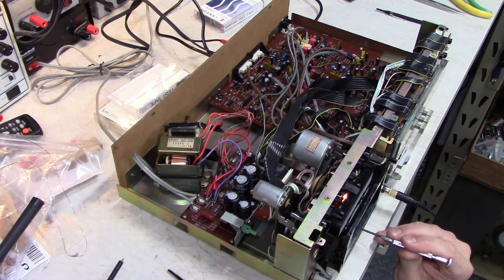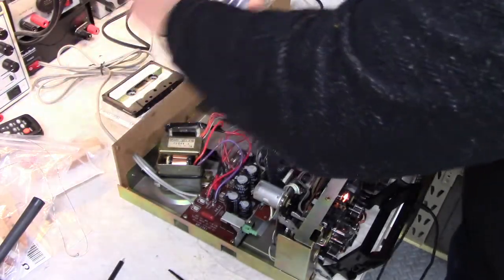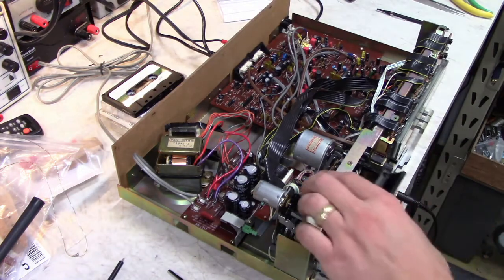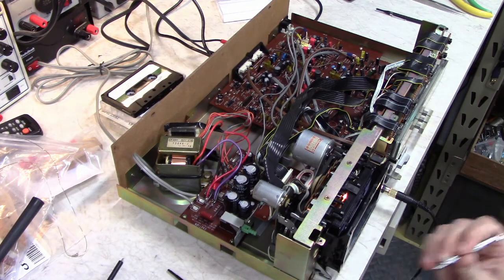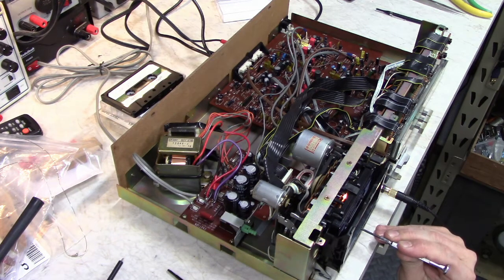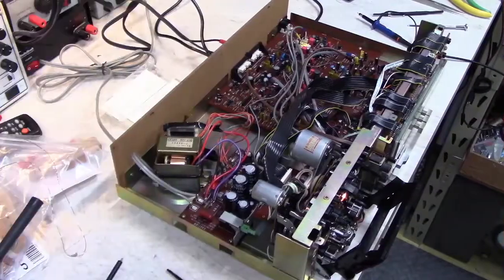The other direction. Check with my other 10 kilohertz tape. Just going to double check. Yeah, it's pretty much right on. Okay, so the head azimuth was correct, the tape speed was correct. Just going to double check the playback level.